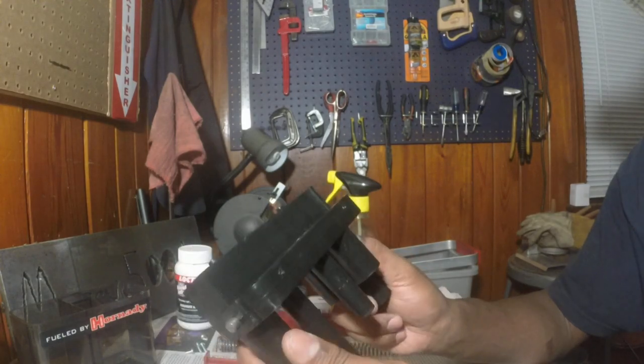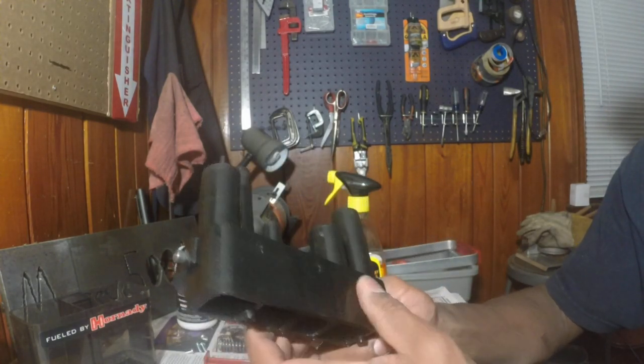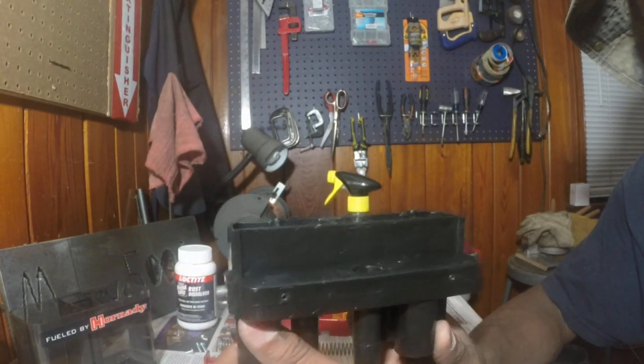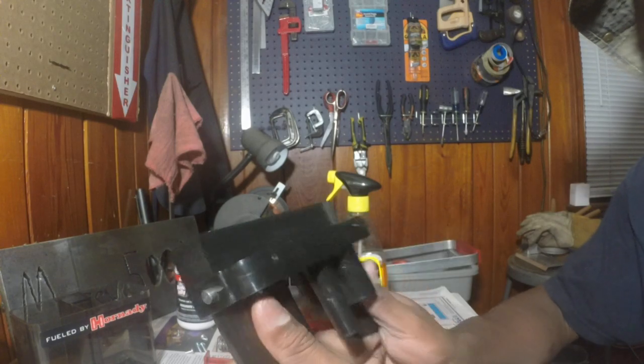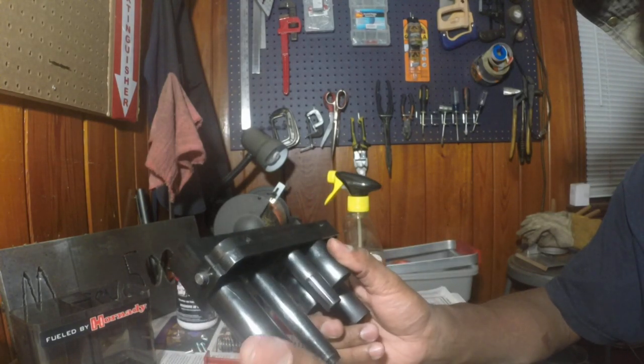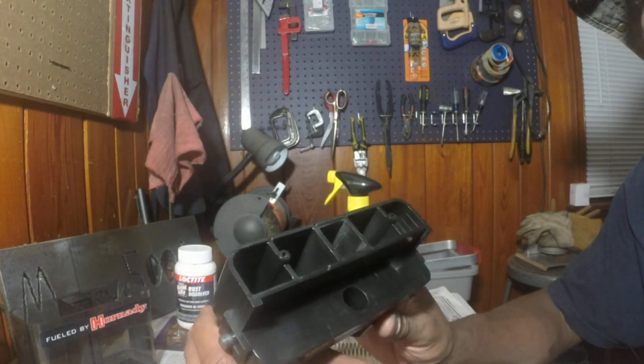And generally there will be powder on this, so I actually wash this in the sink. You don't want to use something like acetone, because it could damage the surface and compromises integrity, because acetone is very strong on particular plastics, so on polymers.